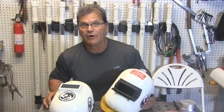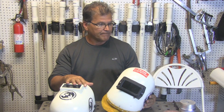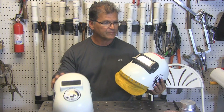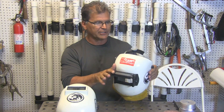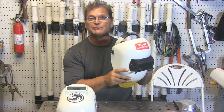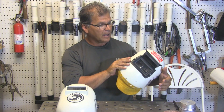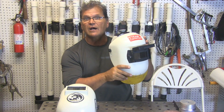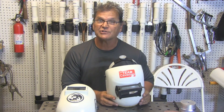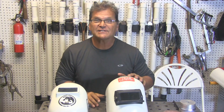My friend Alex Brown — he's Caveman Welder on Instagram, we had him on the Welding Tips and Tricks podcast — he sent me this afterwards: a modified pipeliner helmet with a Sellstrom flip front on it. It's cut down a little bit to make it lighter and smaller, with a little leather chin flap on there. It feels really nice and lightweight. The benefit of a flip front like this if you're not going auto-darkening is number one it's just not going to fail you, and number two it doubles as a grinding shield — very handy for wire brushing or grinding if you can't find your grinding shield.